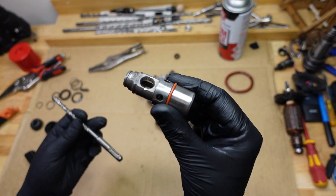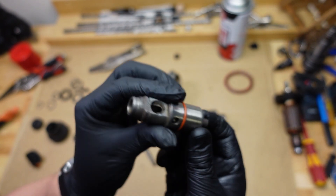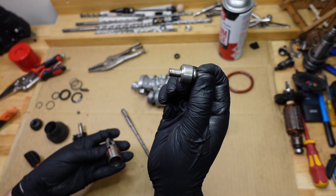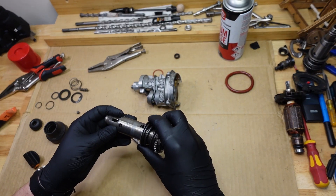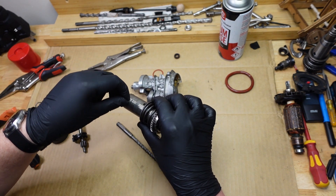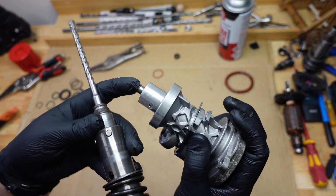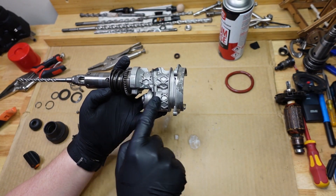This part here is the actual tool holder that the drill bit goes into. If you ever look in the back of your chuck, you should see that little guy there — that is the striker pin, slash anvil. It's a hammer and an anvil really, because it hits this but is also hit by that other part. I just like calling it the striker pin, because that's what the part is called if you have to find a new one. This lives inside here, held in with a couple of little pins. The drill bit sits inside there, and then the piston and the little pneumatic hammer end up inside there. That's the whole mechanism for the hammering.